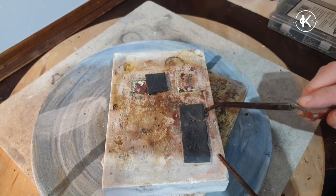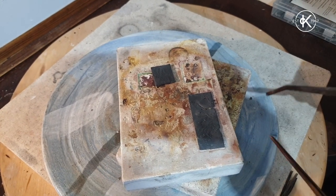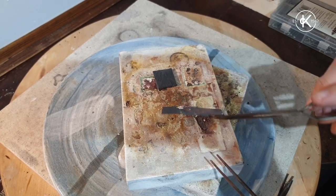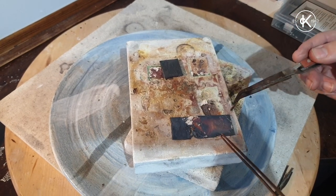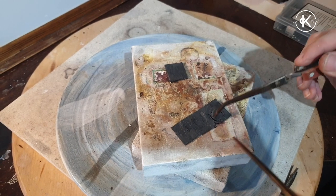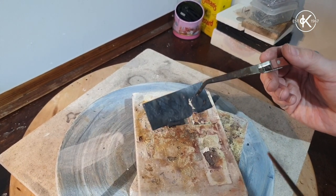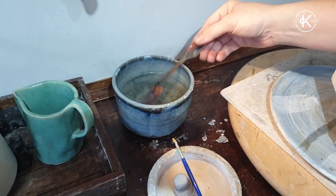That one's come away alright, but it's not unusual because we get so hot — it's not going to be stuck to the brick. Normally if you're not impatient just leave it to cool and it will release on its own accord. If you do force it off you run the risk of taking half the brick with you, but that will chip off. Another thing is with any of the metals, but brass in particular and copper as well — if they get too hot it burns through at that point. That can give some nice effects, but I'm just going to cool it.